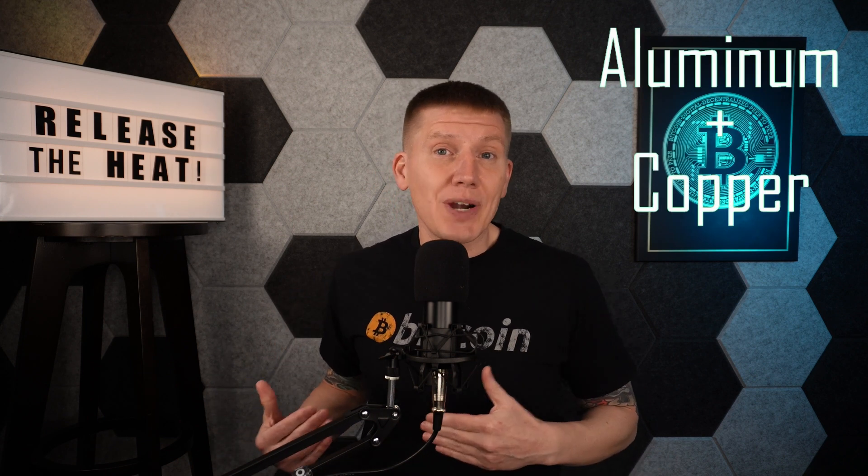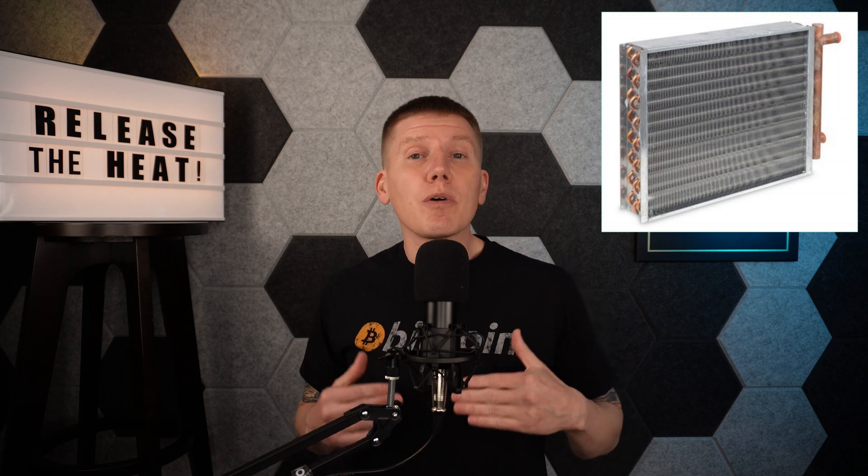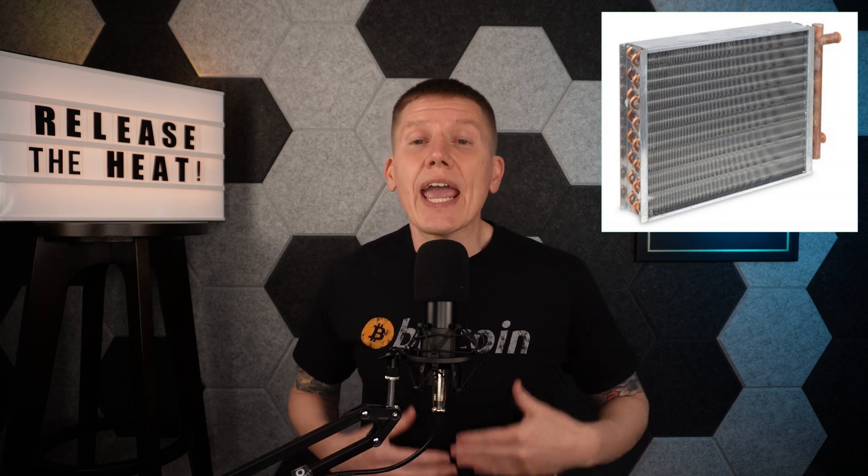The last dry cooler option is the DIY build-your-own approach. The first part of a DIY cooler setup is the radiator. Some folks have tried to use an automotive radiator, but that's really not the best type to use. Most automotive radiators are made out of aluminum, which is a reactive metal. In a dual loop system we'll likely have a braze plate heat exchanger with copper components, and mixing copper and aluminum in the same cooling loop will likely result in galvanic corrosion, which will eventually destroy parts of your system. Instead, the type of radiator you want to use is a water-to-air copper tube heat exchanger — fairly cheap, available in many different sizes. I have a link below for some examples.